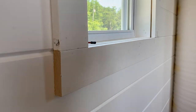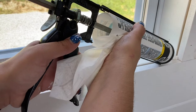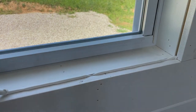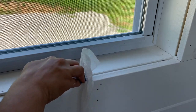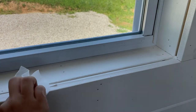I did want to attempt to make it look seamless, and whenever I painted everything a final coat with white paint it helps some. But this seam here — the same on all the windows — is a pretty big seam and I did not want to leave it exposed. This actually took three layers of caulking on the inside. What I did is lay a bead of caulking down, take a baby wipe and go over it to smooth it out, then use the caulking left on the baby wipe to go back over parts of it again — adding layers after each layer would dry.